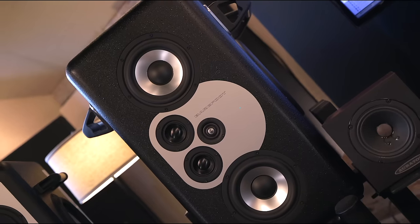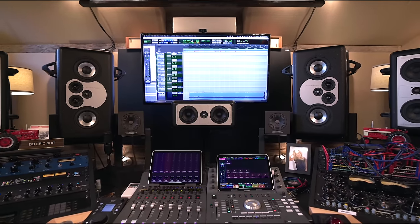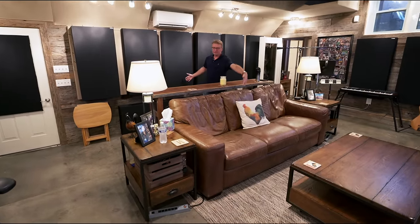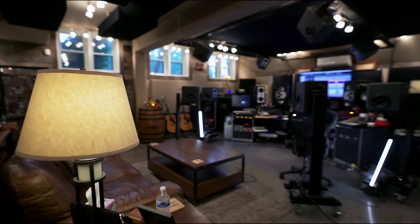As we work the room with the MM12s and the amount of low-end output they can put into your space, I kind of started to work it out. It's really a treat to sit in here and listen to music. Having the couch where it's located from the back wall — they're not against the wall. You know how you get that bass build-up? I don't care what room you're in. Having them up here, they're about 6.5 to 7 feet from the back wall. The client couch is a really comfortable listening position — they can really hear what's going on.